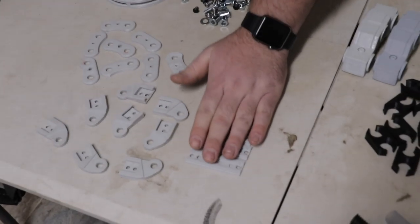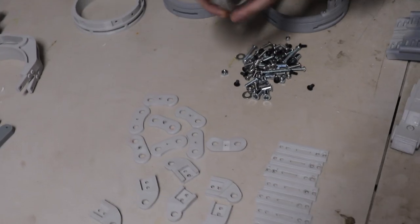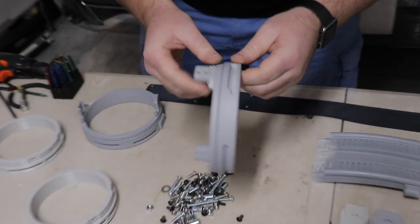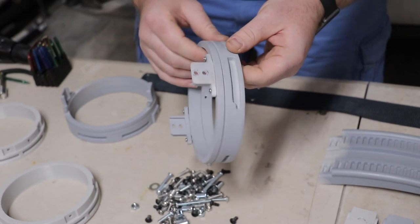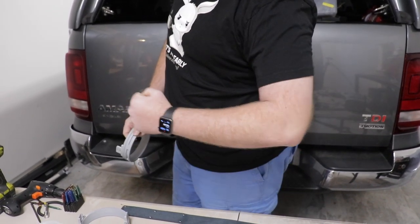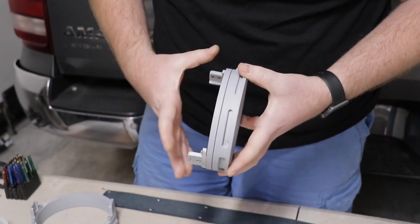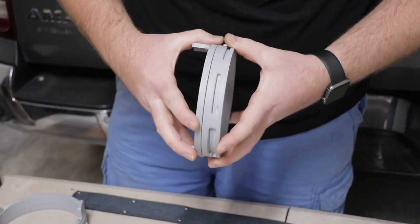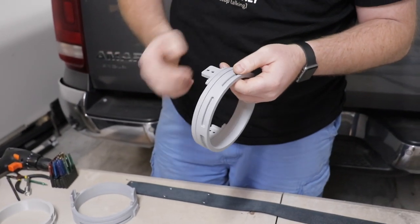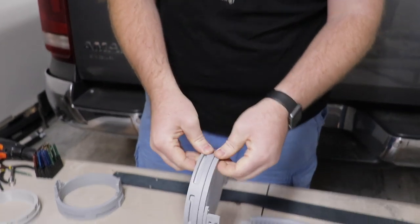So this is the arms. We've basically got these connectors that join those arm bits together. These are the actual joints themselves — like the hinges. That is the forearm ring. These bicep rings — this is something I was so impressed with. If you think about an arm movement — if it's completely solid through there, you'd be able to move your arm like this, but if you tried to move your arm like this you'd snap something because these hinges won't literally move that way. So there had to be a way to do it. What we've actually done is printed this in two parts — on one side there's basically a hook, and the other side it's the opposite side of the hook with a little chamfer, so you can push it together, it locks in, and it's not coming apart. It's quite solid, just to hold the weight of the arms.